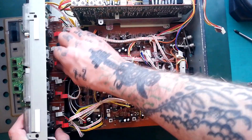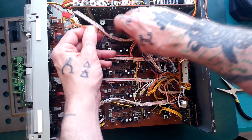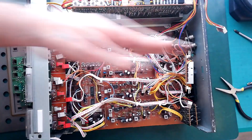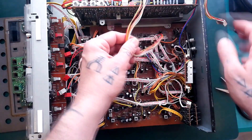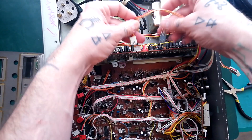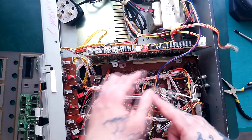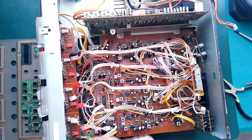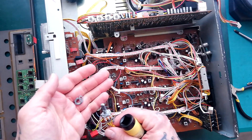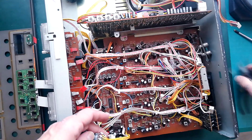I've also detached this orange one on the black header — not entirely sure what that is, may be a power thing. It's got a couple of zip ties, ending up in the top left corner of this board. Cables are coming around here and terminating in a black and a white header respectively — both four-pin, and because the header and connector match in colour plastic, you shouldn't get those mixed up. And here's the power cable powering that board we identified earlier. There are a couple of connections that look actually soldered in. That's the headphone pot — I'll unscrew that quickly using the 11-millimeter socket from a socket set, but you could just use needle nose pliers. I'll put the washer and nut back on so I don't lose them.